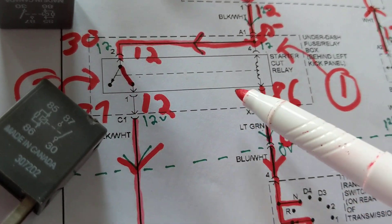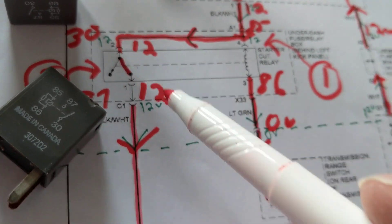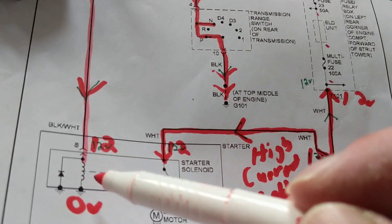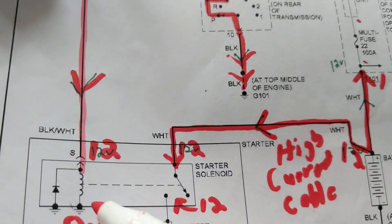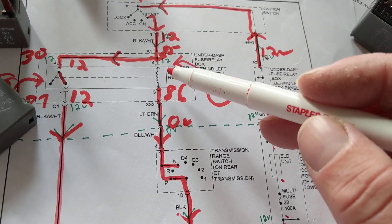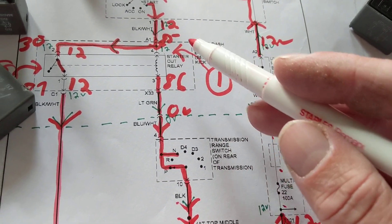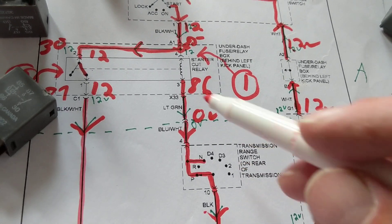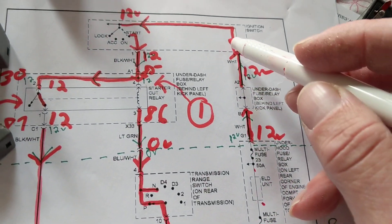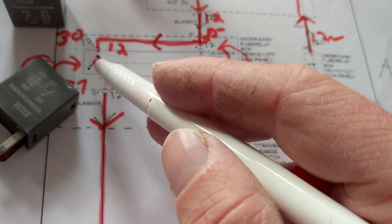The contacts will be in the closed state as long as there is a magnetic field. Now, am I going to jump the load side? That's actually the best way to do it — because in this circuit I still have some resistance going through the starter solenoids. If I go through the control coil side I have absolutely no resistance, because I just took out the relay coil. That means less resistance, more current — you're going to blow the fuses. By jumping the load side, I still have resistance from the coil, and that gives me some protection.